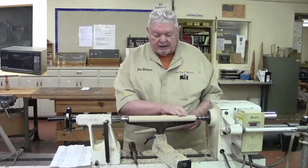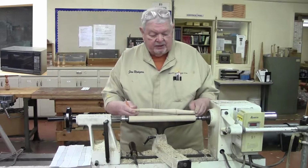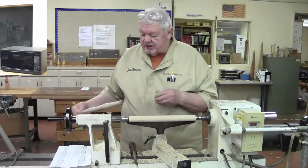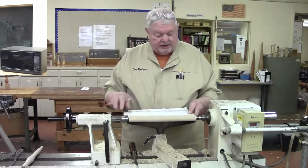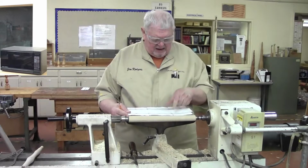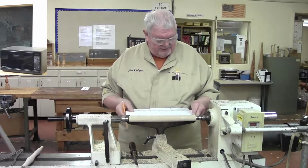We're at the lathe. I've turned this piece of wood down to the maximum diameter of the project, which is this dimension right here. So what I now need to do is to transfer this design onto this piece of wood. And as I showed you the template before, this is the template for the front leg, which is what I'm going to be turning. And I've cut the piece to the right length. I want to mark these transition points, these biggest locations, and these narrowest diameters.